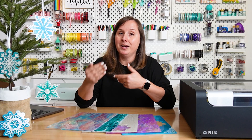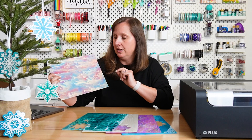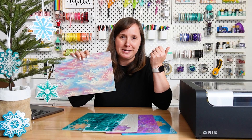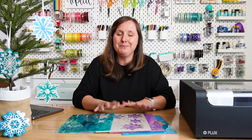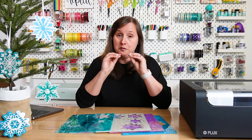So if you have a diode laser, can you cut patterned acrylic? Unfortunately, not that many — and that's because of how patterned acrylic is made. This acrylic here is poured acrylic, and the design is brushed within the actual sheet, which has a clear core, meaning your diode laser will pass right through it. Another type has a laminated pattern on top and bottom, but often the center is white, and a diode laser really struggles with or cannot cut white. I would say probably 90-95% of patterned acrylics are out if you have a diode laser.